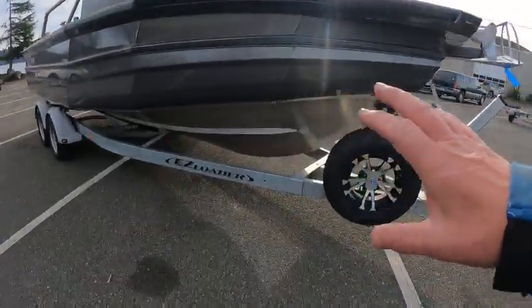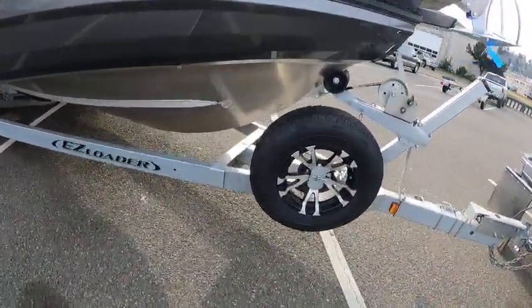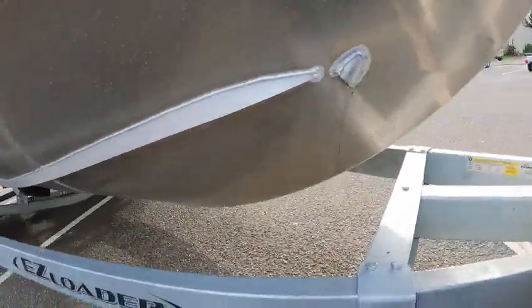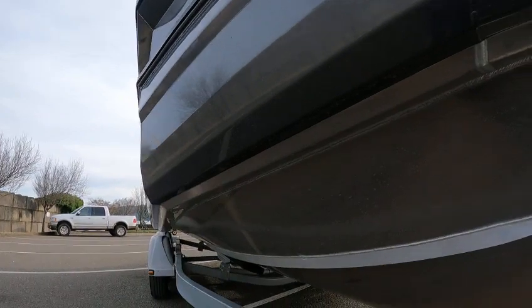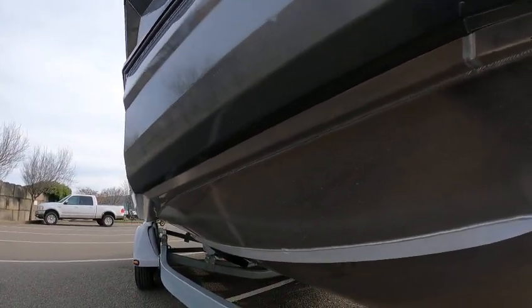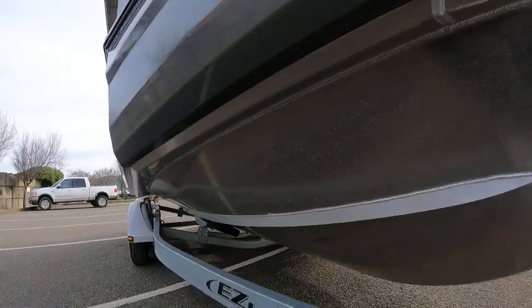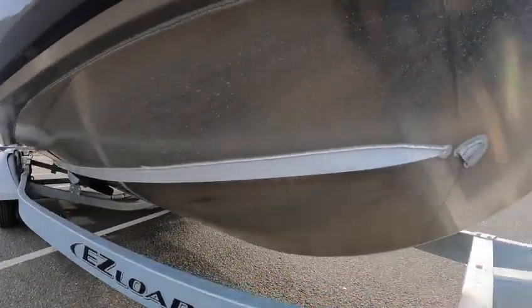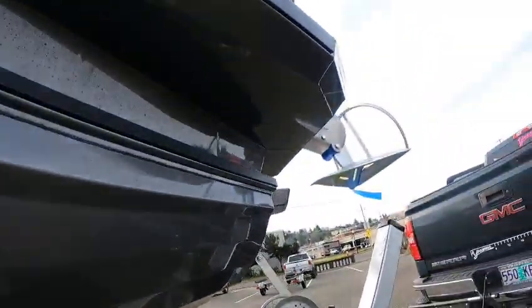This isn't the trailer that goes with the boat — it's going to have a custom aluminum trailer, so I won't go through the trailer too much. It's got G3 tubing, one, two, basically three chambers. Got these reverse chines with the flat part — that's going to keep the boat stable. Those strakes right there help lift but also keep it tracking, and it's got this arrow design.